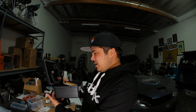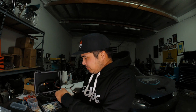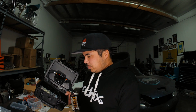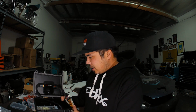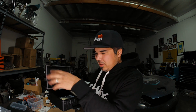You guys saw me cutting out the little holes for the fan and the plug. So basically what we have is the power supply and everything is hooked up now, and it's a pretty simple hookup with just your voltage coming in and out. There is usually a little switch on the side of these power supplies, so make sure you have the right input switch for wall power, which is usually 115 volts. Just make sure it's on the right setting there.